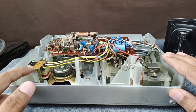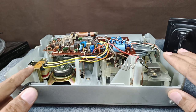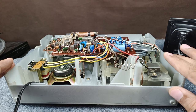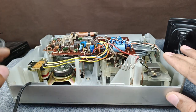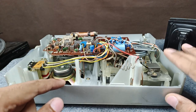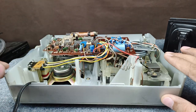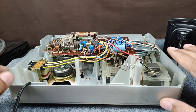In this video I'm going to use the 909 transformer, but I'm going to regulate my 909 by using a 7808 regulator IC. Since with load it goes to around 8.3 volts, that's why I'm using 7808 and not 7806. This unit is 6 volts when using battery, but I won't use a 6-volt regulator IC because there's a tendency the voltage will drop due to the load, especially from the motor and the radio.